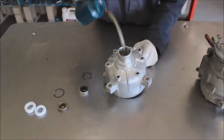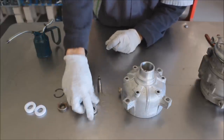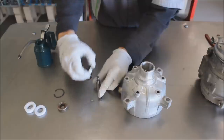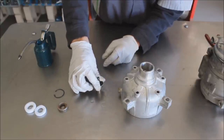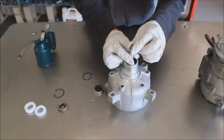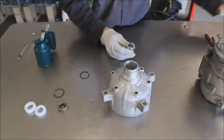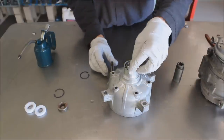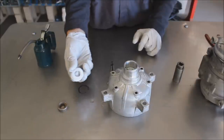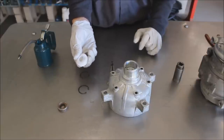Lubricate the seal and the O-ring. Then do another preconditioning on the shaft seal itself. There's the outer edge that faces you, and there's the inner edge with the bulge that goes down onto the shaft. Run it over the tool essentially backwards — push it down to expand it, then pull the lip seal out. With the compressor shaft sticking through, put the seal down just like on the other compressor and work it down forward. Once it's seated, take a socket and push it until you feel it seat into the housing. Then install the snap ring with the bevel facing out. A lot of kits include felt washers, but I don't actually use them — they have a habit of coming apart and getting caught up in the seal. If the seal is sealing tight, it's really not an issue.